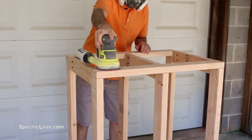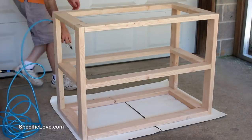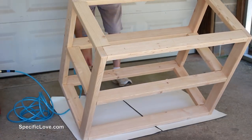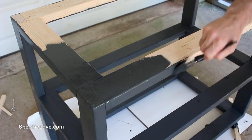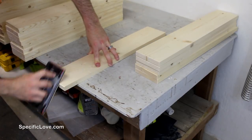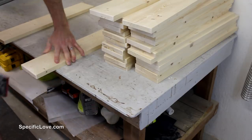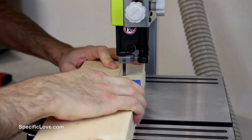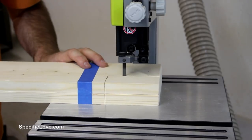I had planned on covering most of the discolorations with stain and just smoothing out the imperfections, but I quickly learned that I should have used some clamps in a few locations. After some time, I finished up and used the air hose to prep the frame for staining. For the frame, I decided to use a gray stain. While that dried, I went back to the shelf boards and used a hand sander with 120-grit paper to help remove the splinters. On four of these boards, I had to cut a small notch to fit around the frame, and a bandsaw made quick work of those.